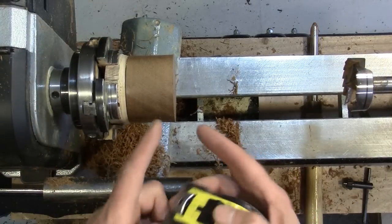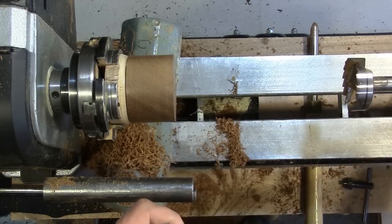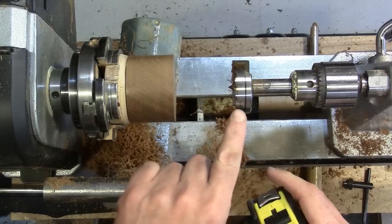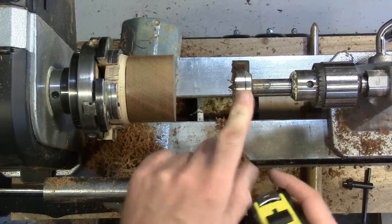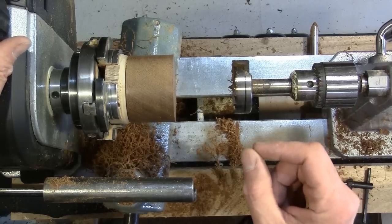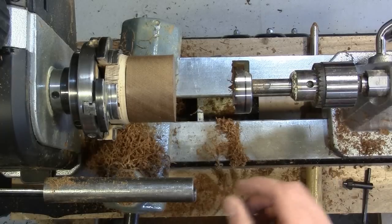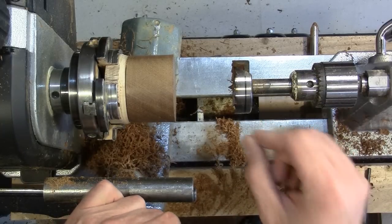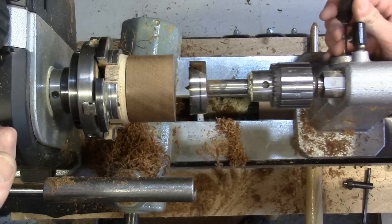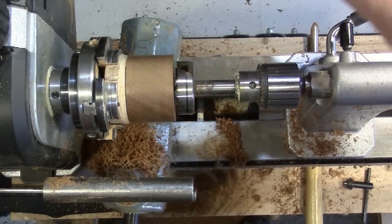Okay, so my tumblers are 1/2 inch is what I'm making them. On the last one I did on the video, I didn't come in quite so far. I remarked this. I'm coming in 3/8 with this bit right here, because I'm using bigger pins. The pins I used on the very first one were super small and really flimsy. So I got some bigger dowels, and I got a maple dowel. So it's nice good hardwood. I can't remember even what the other dowel was, but it was just too small. So I want to give it a little more room here.